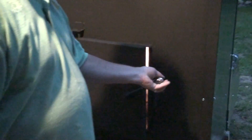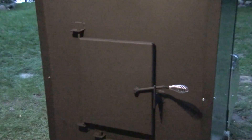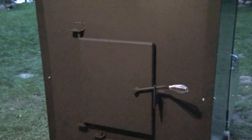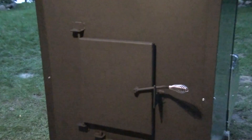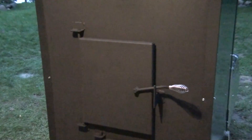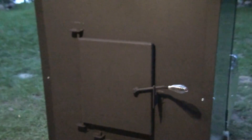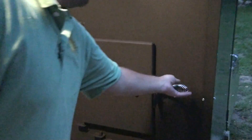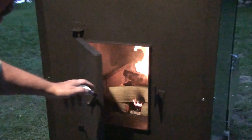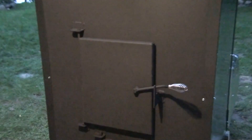Right now we're doing a break-in burn with a small fire in there. We're going to let this stove get up to temperature. This particular stove is set so that the air chamber fan comes on at 130 degrees and goes back off at 100 degrees. It's going to take probably five minutes for this to build up to temp.